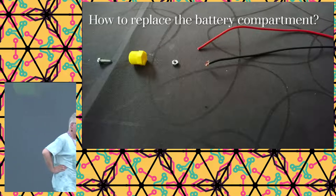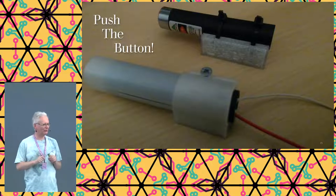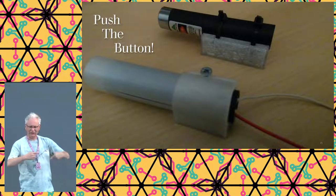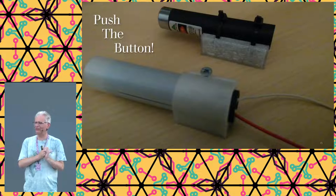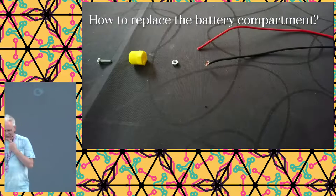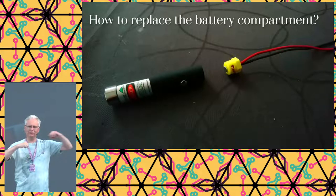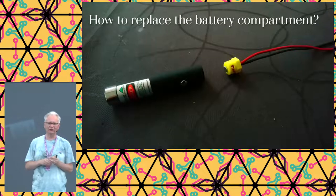Other story first. Because I still have that other end, right? What you see here at the bottom one is that we just soldered the wires. And you need to keep in mind that there's a spring to push against the batteries that you need to solder again. Spring is not standard metal, so soldering doesn't really stick. And on the inside of the tube is a brass ring that contains the thread, and that's also not really nice to solder against, so it didn't stick well. Because we wanted this to be at least a little bit sturdy, I 3D printed a small piece, and I would hook it up together like this. So the screw is on the top that will push against the spring. And I have the wire on the other end that will spread itself out and fill up the room that the thread gives.